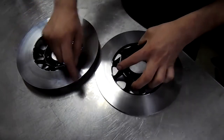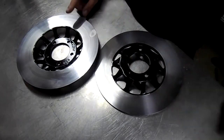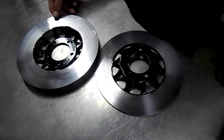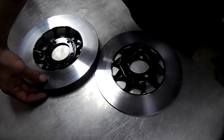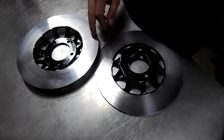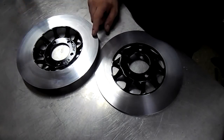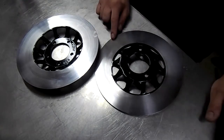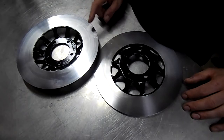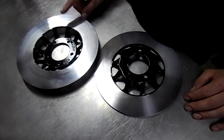About the thickness — the minimum thickness for these discs is 4mm, but I wouldn't skim it to less than say 4.3mm, because obviously once the pads start wearing the disc away, if you skimmed it to 4mm it's going to become thinner than that. So you've got to make sure that you're a little bit over the minimum thickness when you skim them. And this method wouldn't work with floating discs — it only really works with the older style single piece offset discs.